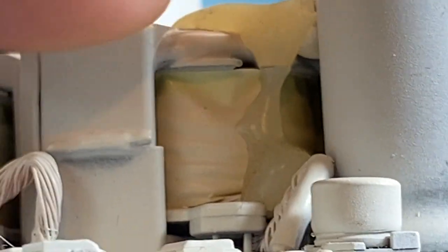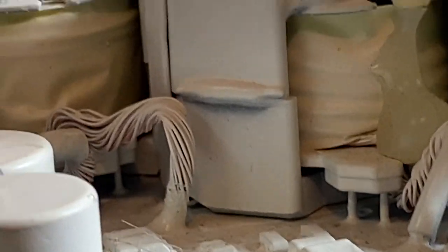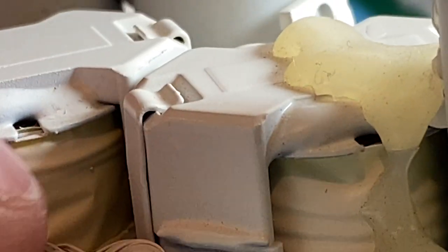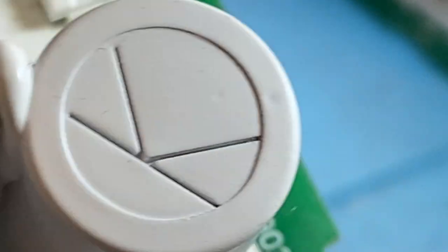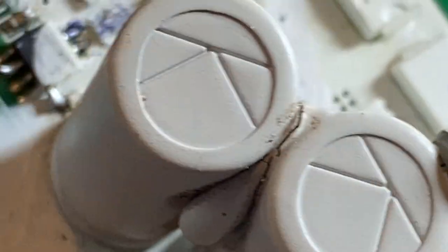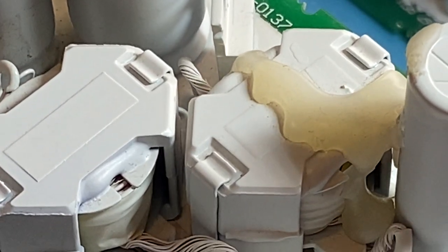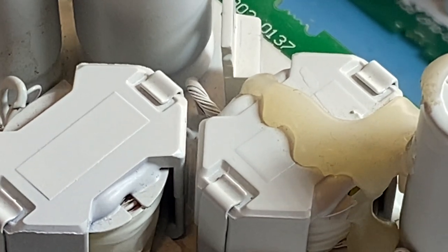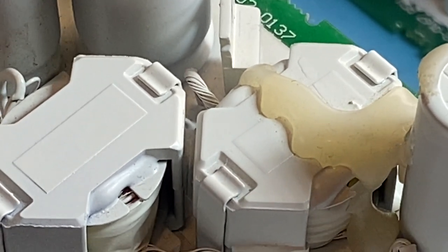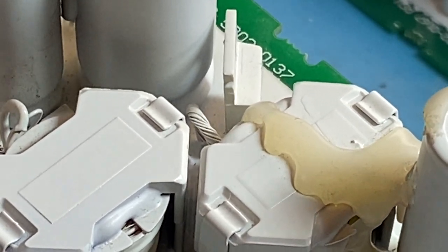The other thing with mass that can come adrift, whoops, there we go, the ferrite transformer and the inductor, these are fairly heavy. You've usually got leads coming out, so it's not going to pull out. But I think there's one of these that might have a pin under the board that solders through it. It can pull through. I haven't replaced an inductor for about 6 years. So they're not a failure thing, but if it comes unglued, it won't work.